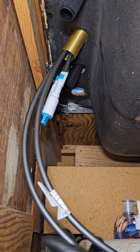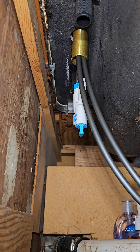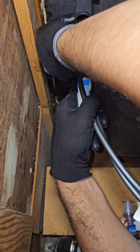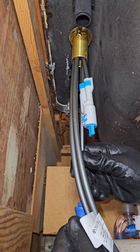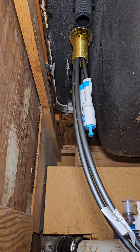For the silicone lovers: no, I do not use silicone. I trust the gasket on the faucet — never had a problem, that's how I roll. Putting the new Delta faucet on with the plate to cover all the holes. Using the rigid tool for the plastic nuts — can't beat it. If you use the basin wrench they'll break, so that red tool saves lives.